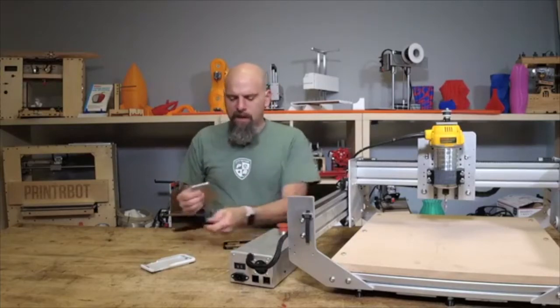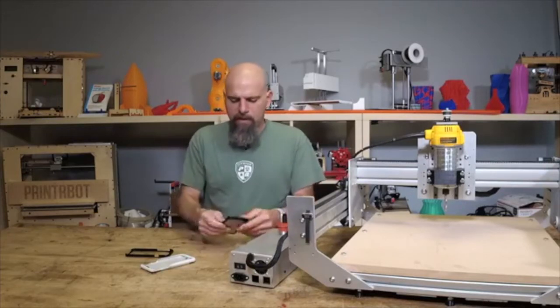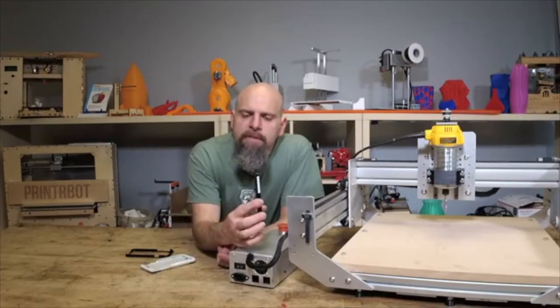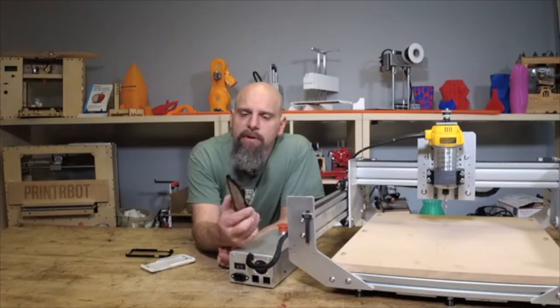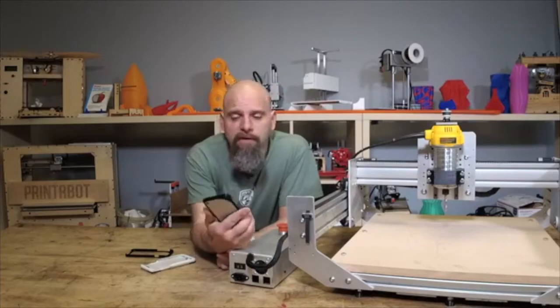Anyway, the reason I was thinking of it this morning is this guy wants to do some in-store demos. There we go. So, a really, really nice fit. This is actually just PLA. We usually test in PLA first. Right now we're printing these with a 0.75 tip on a Simple Pro, and that means you can't use the cloud, and that is really starting to bug me. If these printers get placed in a mall or cell phone store, they're not going to want to upload a .gco file. They're going to want to see a picture of what the cell phone case will look like. They're going to want the slicer in the cloud to slice for the tip that they have, 0.75.